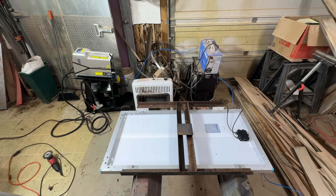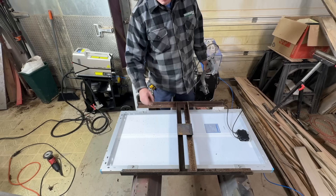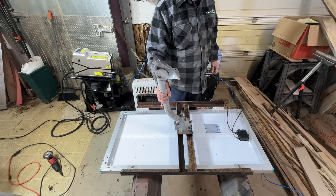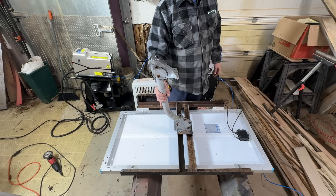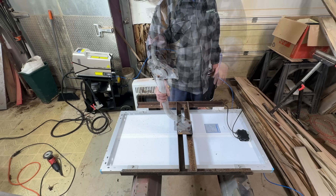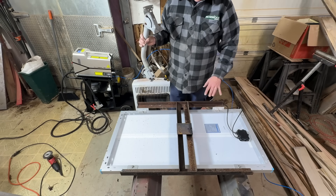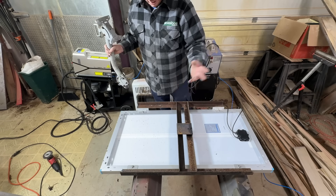Here's the rough layout I came up with. This will allow us to have bolt points on all four panel brackets. Angle iron should give us the strength, and then this plate will be our mounting area — it'll mount right here. We're not going to weld that, just bolt it. That should give me plenty of clearance to twist and turn without coming in contact with the post of the barn. We're going to get it all cleaned up, get the cut edges ground down smooth, take the laser cleaner and knock all the rust off so we're not starting with something rusty. That way we can get good welds, good penetration, and also be able to paint the frame afterwards so it doesn't rust up.